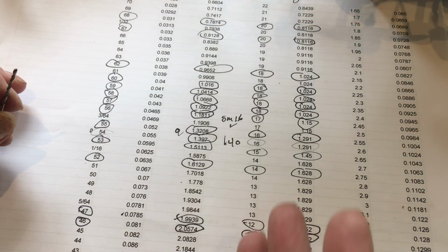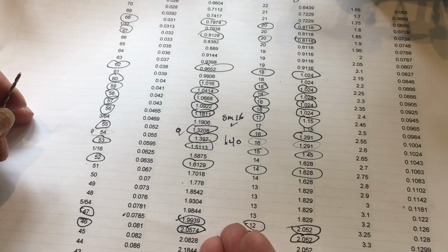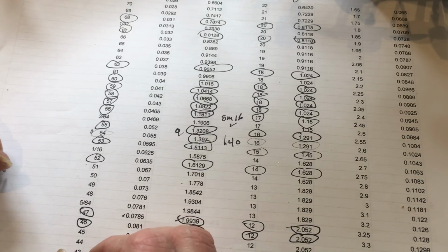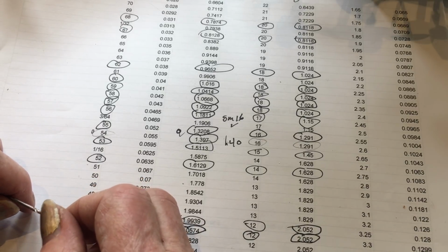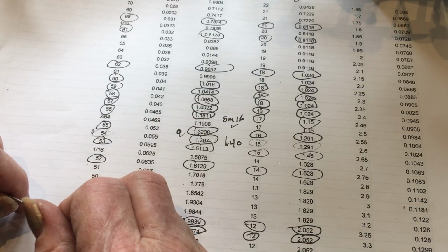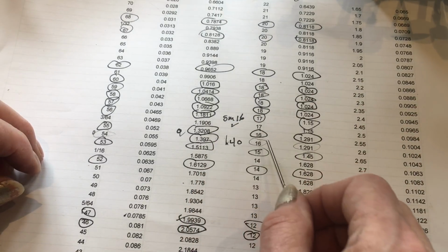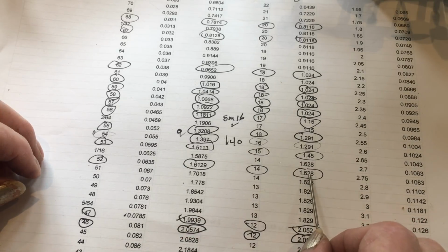When you're trying to drill a hole, the first thing you have to determine is that the hole needs to fit whatever is going into it tightly. In almost all cases, it's wire or tubing. With riveting, you definitely want a nice tight fit so that if you turn it upside down, the wire doesn't fall out. The problem with some of these gauges, like 18 or 16, is there's so many choices, but there aren't any that are exactly or close enough to the drill bit size.